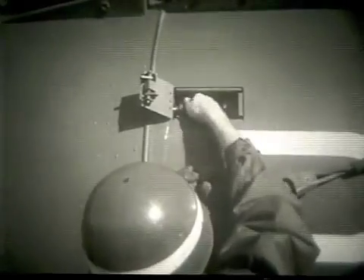The completed missile body, now resting on the warhead trailer, will be mated to the missile thrust unit. For this operation, the thrust unit was suspended from the A-Frame rigging. The two sections were aligned for mating with the use of six ball and socket guide pins. The two missile units were then mated by threading six explosive bolts through the six guide pins.